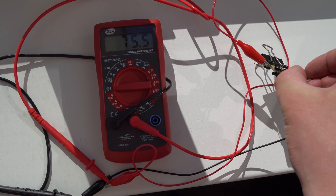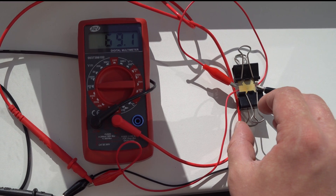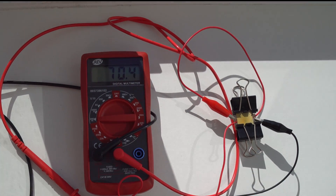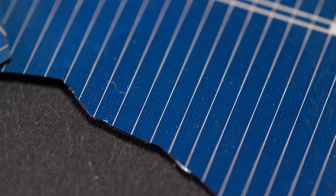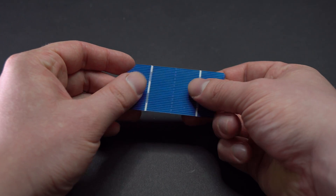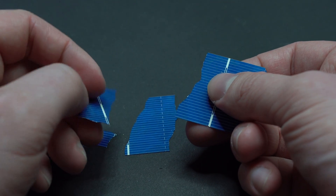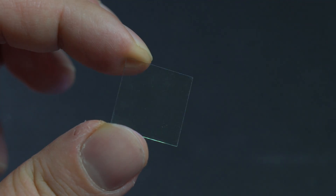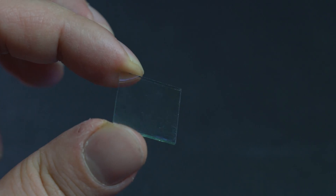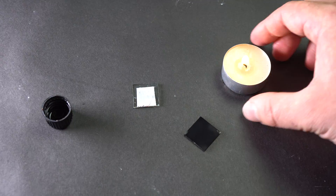When I assembled the cell it began working strangely and turned into a battery too, but about 50 minutes later it also stabilized and it too worked just as well as the cell with pure titanium dioxide — it even seemed to perform better. Apparently the small amount of titanium dioxide in toothpaste is enough to make a semiconductor and move electrons, due to the porous structure of titanium dioxide and silicon dioxide which prevents electrolyte from evaporating too quickly. In sunlight, voltage and current readings were a bit higher than with torchlight, and you could clearly see how the angle of light impacts efficiency. I think it would be great to run this experiment at schools — pupils would be able to make a solar cell with their own hands without expensive equipment. Of course at this point this type of solar cell cannot compete with silicon or other inorganic solar cells, but scientists are slowly modernizing them — for instance, berry juice can be substituted with more efficient ruthenium complexes, and expensive glass can be substituted with current-conducting plastic. By the way, this solar cell made with toothpaste remained working even 12 hours later. Maybe in the future solar energy will become more affordable thanks to experiments like this.